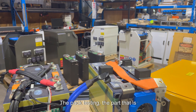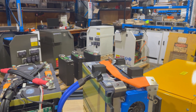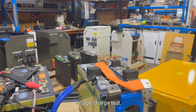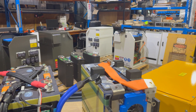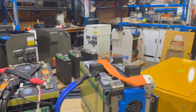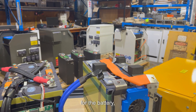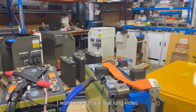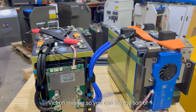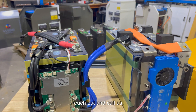The pack testing covers important requirements not included in the cell test: a drop test, an over-voltage charge test, an over-current charge test, and a temperature cutoff test — covering the basic safety requirements for the battery. Note that a battery sold in Australia doesn't require that certification unless called in by the standard — in a mobile vehicle, portable office, or site shed you do. I'll show it quickly connected to a Victron inverter so you can see the data you get out of it.